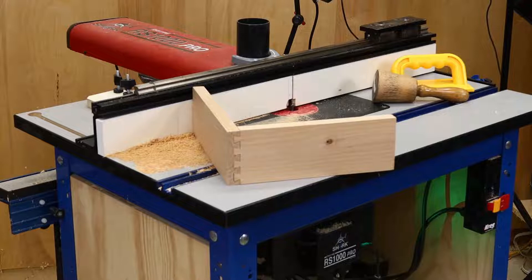There are a couple of things to consider when cutting half-blind dovetails on the RS1000 Pro. The most important is that you must be very consistent when feeding your stock over the bit, since the slightest variation while routing will negatively affect the fit of your final joint. That's why it's important that your fence and sliding miter are set up perfectly square. Also use the same amount of pressure with each cut, and check that there are no wood chips or sawdust under your board or between it and the fence. With a bit of practice, you can make nice fitting half-blind dovetails on the RS1000 Pro. For links to other RS1000 Pro joinery apps, see the description below this video.